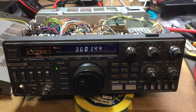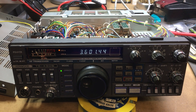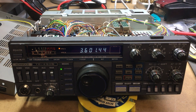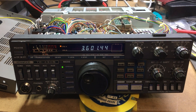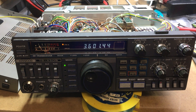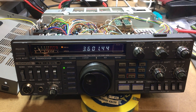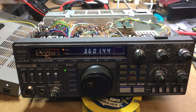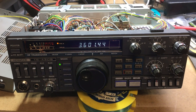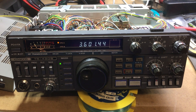I still had the PLL out of lock, but I thought the first thing I'm going to check is which band am I in, and therefore can I adjust the right VCO for that band to get the right voltage — because my voltage was 0.77 volts and it should have been 2.1 volts for the first three VCOs on that board. So I did the first one and after a bit of fiddling around with the pot I was able to bring the voltage up to 2.1 volts. I then proceeded to change bands and did the same for the 14 MHz band and the other two as well. When I looked down at the radio I had a digital display — a frequency readout — so the PLL was now locking, which was quite a bit of progress.